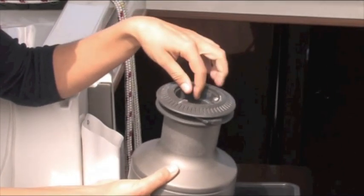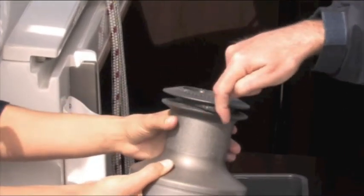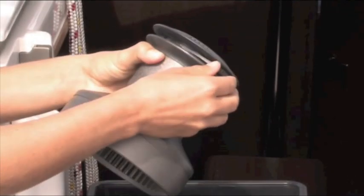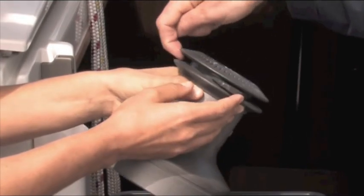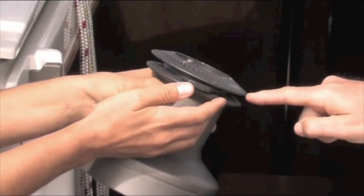Should I pop these off as well? You can do. This is the stripper ring — just make sure it's free moving. If it's not, take it apart and replace the stripper ring. Why is it called a stripper ring? Well, the rope from the feeder arm feeds around here, locks into the self-tailing crowns, and it strips off the rope in this position here.